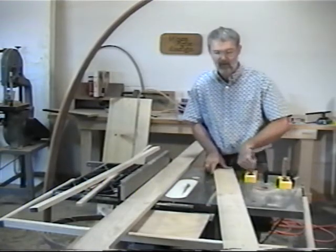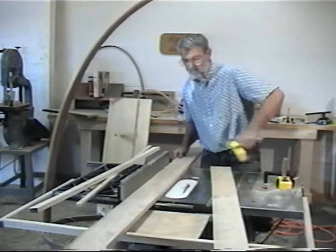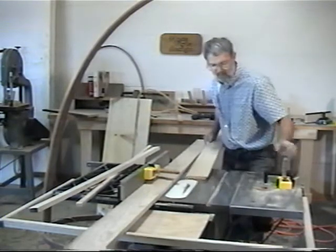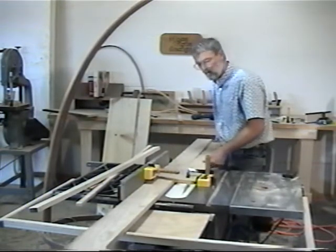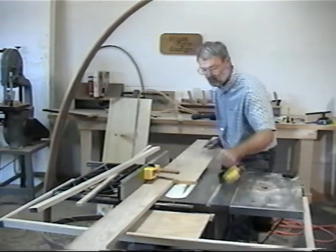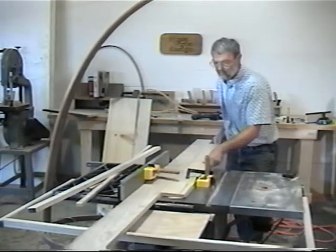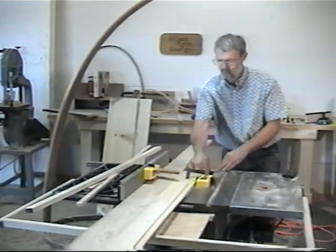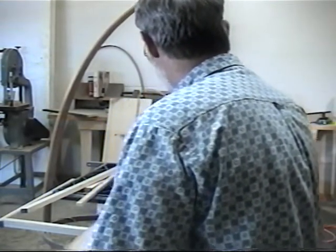If you have a board that has a bad bow in it and you want to straighten it out, take a straight board, hold it down to the fence with a Grip-Tite. Take your second Grip-Tite on the deck and hold it over and down against the fence. Be sure to put the concave side of the board against your new long fence. Don't put too much pressure on the tabletop Grip-Tite's fin. It has to bend as much as the board is bowed. With a good blade, you can get a glue line cut every time.